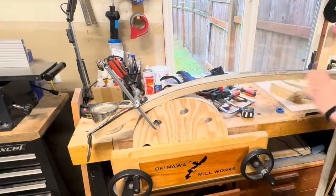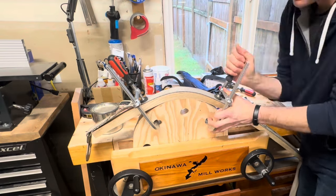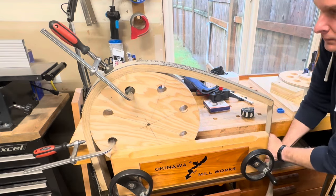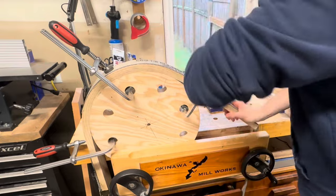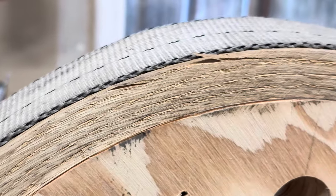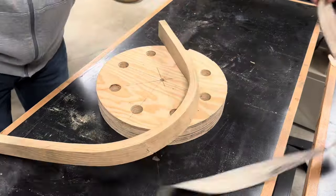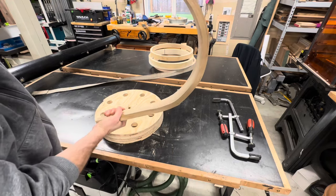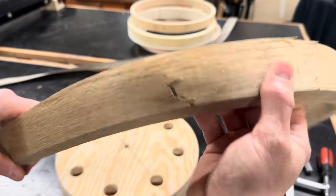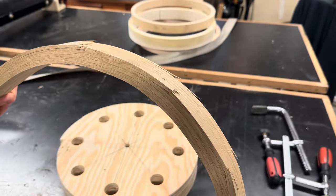Since this is the last bend of the video, I figured I'd go for broke. That first piece was 3 quarters of an inch thick — this one is 7 eighths. The wood is white oak, it's fairly straight grained, I soaked it overnight, and I steamed it for about 90 minutes. I did get some splitting right along the outside, and I think that's partly the grain but mostly the piece was just too thick to be bent on this kind of radius. I left it on the form over the weekend, and on Monday I had remarkably little spring back. I kind of wish I had tried with a piece that was only 3 quarters of an inch thick, because it might have come out perfect. That outer surface just pulled apart because there wasn't enough material to make it around the bend. Anyway, I know this has been long and it's a journey, so thanks for watching it with me. Here's a picture of my cat.